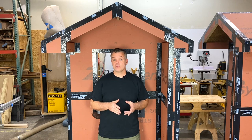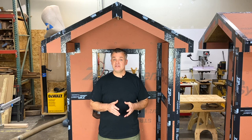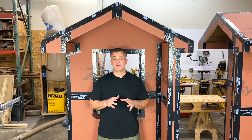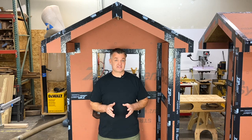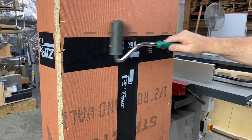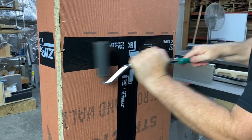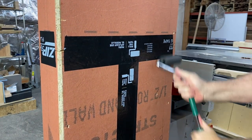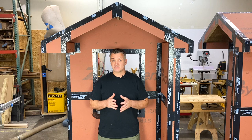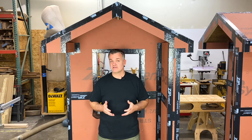The next step is rolling the tape. If you were to look at tape under a microscope, you would see it's not very even or flat. And if you want the tape to last, you need to get full contact — this is done by rolling the tape. The biggest issue people have is not rolling the tape. Here's an example of not rolling, and here is what it should look like: using both hands to apply pressure, rolling the entire surface of the tape, and ensuring the ends of the tape are thoroughly pressed in. The ends are common spots that can start to peel up when improperly installed. The ends need the most attention, as they can easily collect dust during application, and your fingers and oils get on the tape. Rolling presses out the adhesive, allowing better contact.